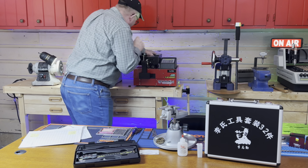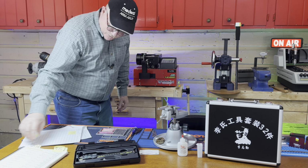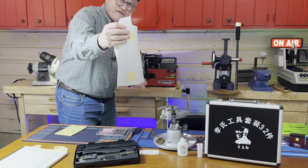All right, now we're gonna put in the bidding because it's already set. So we put our book away. I take the bidding, I've already got a master key chart. The bidding on this one is 857861. So there's the bidding, and I just check myself, 857861. I put in code. I cut a real Sargent key. This is not a knockoff. This is a real McCoy. Here we go.